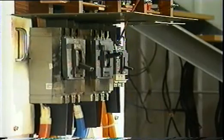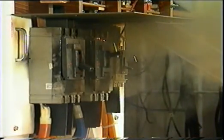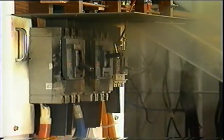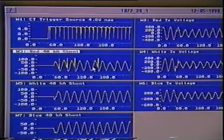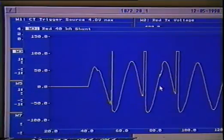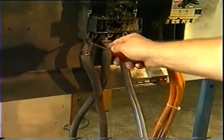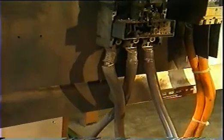The penalties for failing to ensure a safe working environment can be substantial, and company directors are personally liable for employee safety. Higher energy let-through with MCCBs poses significant risks to downstream equipment. The cables moved around much more when we were operating on the circuit breakers, indicating that there was much greater let-through energy than in the fuse situation. So there's much more potential for damage.